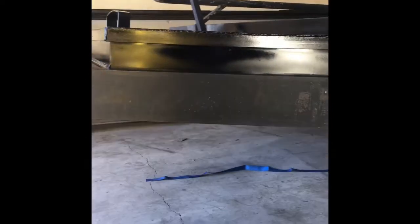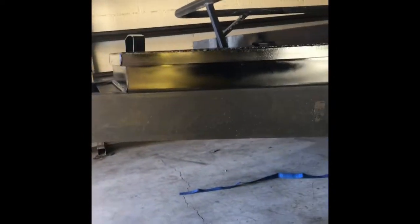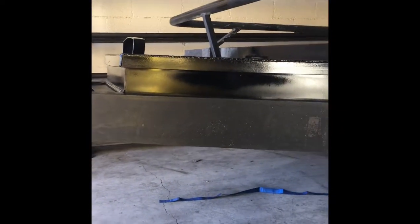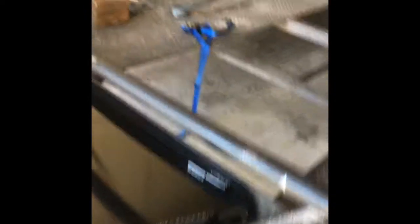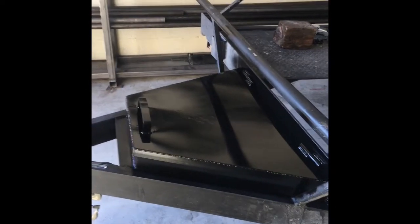And there it is — we have this sleek small box that looks like it's only three inches tall but actually goes seven or eight inches deep. I didn't put any locking system on it yet, which I might eventually do — there are tons of ways to do it. One thing I wish I'd done differently: you can see up here it warped from welding, so I wish I'd been more cautious and maybe added a support on the inside. But it turned out pretty good. Open it up and you can see what's inside — I can store my straps or whatever else I want in there. Hope you learned something, and if you have any questions let me know.